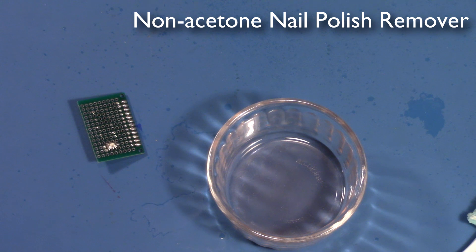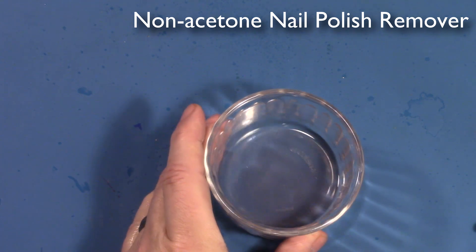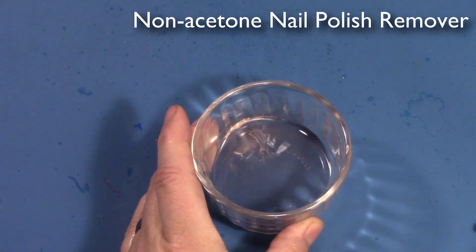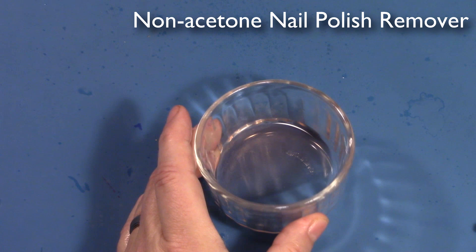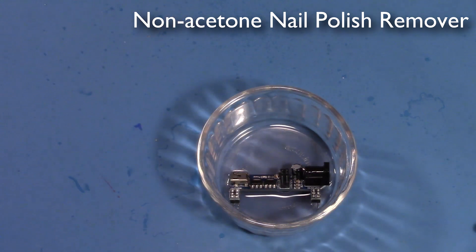I don't see the white spots that I did with the isopropyl. The one odd thing about this is it has a slightly smoother, slightly greasy texture. It hasn't evaporated completely when I hit it with the compressed air — I don't know what it'll be like after time. But it seems to have done a fine job of taking everything off, and I don't see any damage to the board. This other one looks pretty good too. However, there is a slight red tinge — there's a dye in this, it's supposed to smell not so nasty. I'm not sure whether that will leave anything on the board. We'll leave a piece of plastic and a button in there and see what happens.